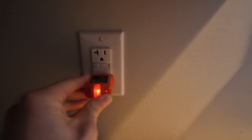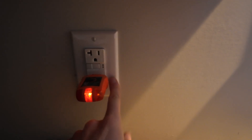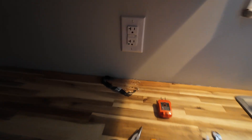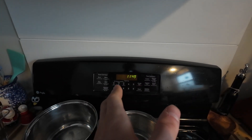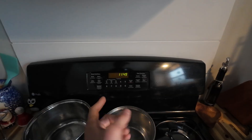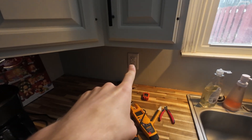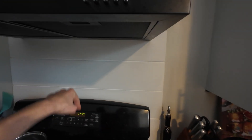Camera died there for a bit — had to charge it real quick. But the power is back on. The first thing you'll see is the little yellow lights — you have to reset. Now look: the oven is flashing. That means when I shut the breaker off, this oven is powered in-line on the same circuit. Since the panel is in that direction, this is probably the line side. So even though we have a good ground at the GFCI, we probably don't have a good ground further up the circuit.